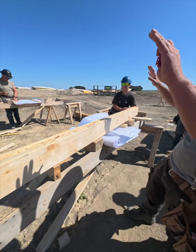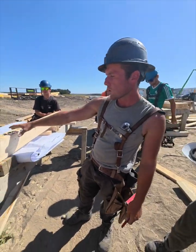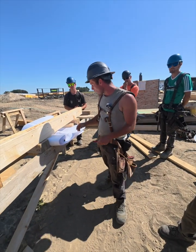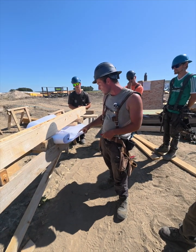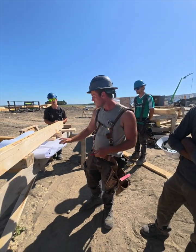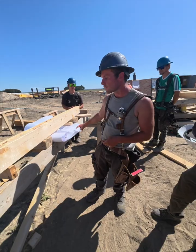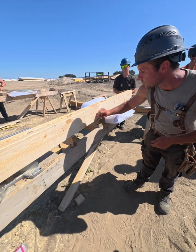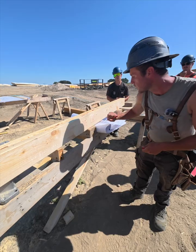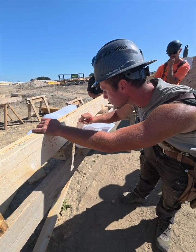We're gonna build these and we're gonna stack them in big piles. So when the installers are taking the walls and setting them in, they need to know which one they're picking up. So I'm gonna mark, this unit is labeled Erica B, and we have a Brady in the middle and an Erica A. So I'm gonna write EB. Oh, first, this is the second floor. So I'll write second floor 2F, and then I'll go EB, and then I'll say front left, because that's what it is.